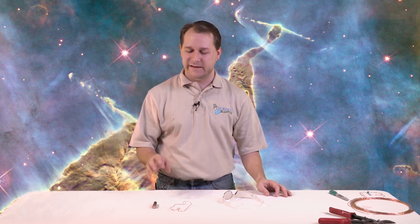I hope you've enjoyed this segment where we've learned how to build a very simple motor, probably one of the simplest motors that you can build, that you can just put on your desk and gingerly watch it spin around. Now I'll tell you, if you spend some time and get the bottom of it looking just perfect, and get some pliers out and shape it to the circumference of that magnet down there, you'll get a perfect fit, and you can let it go even faster and faster.